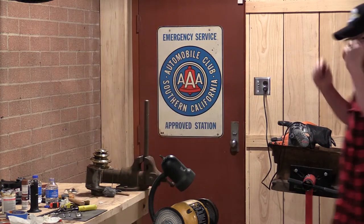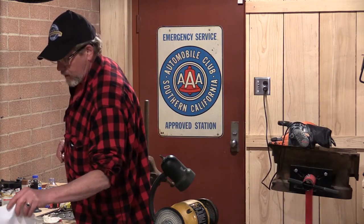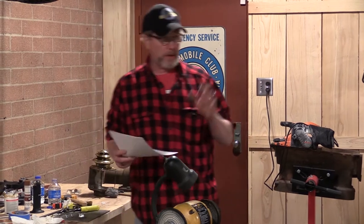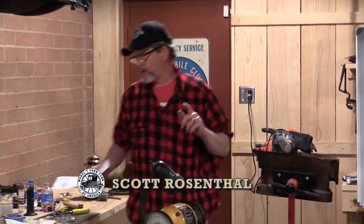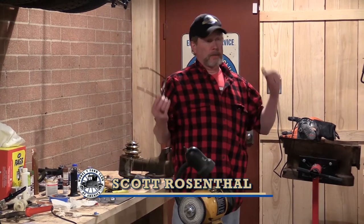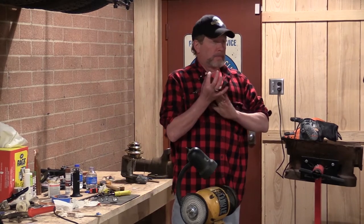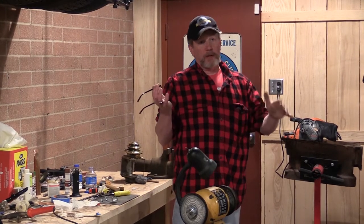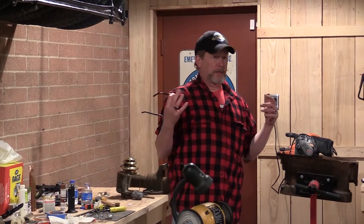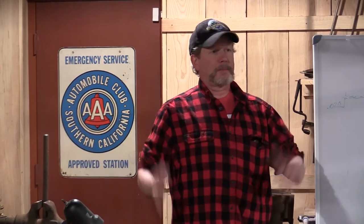All right, I had put together a bullet items list of disassembly, and before I get into this, Joe, I want to step back to a discussion we had a little bit earlier about tinning and why the tinning is necessary. Obviously, when you clean the brass and apply flux to it, my assumption is I ought to be able to put those two parallel pieces together and drop solder in there and everything ought to be wonderful. Sometimes that works and sometimes it doesn't.